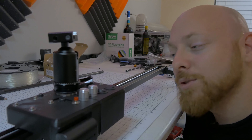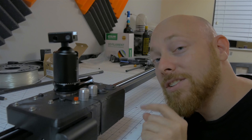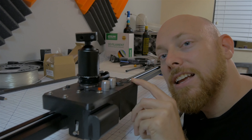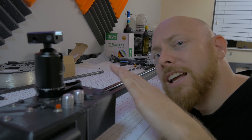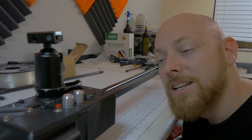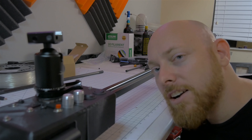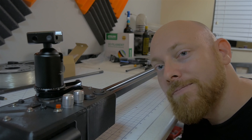Even this version still has its kinks and I'm probably going to have to revisit it. The drive wheel is 3D printed, and I found that if I let it sit in one position for a while it kind of leaves a dent in that drive wheel — you can hear it kind of sticks in certain positions. When the motor's running it's not very noticeable, but it does tilt the camera back and forth just a little bit, which I've had to fix in post. Two out of the three shots in the last video were stabilized. It's minor and easy to fix in post, but definitely something to address down the road.